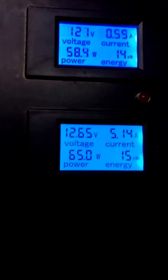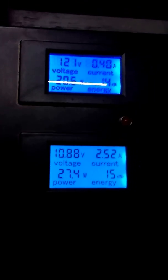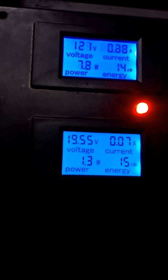If you're using two inverters, they load the turbine down so much — it requires so many amps — that the turbine can never run efficiently and get the full power out of it unless you've got 50 mile an hour winds. So this covers the whole array of wattages, again from 4 to 35 miles an hour.